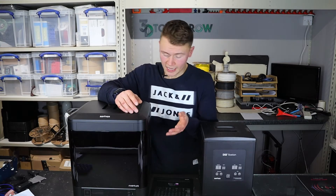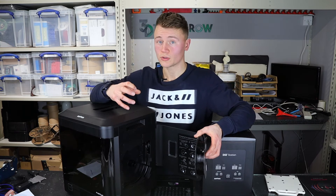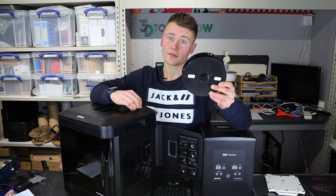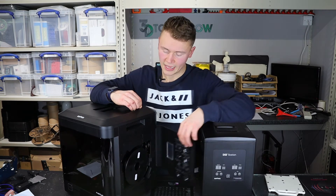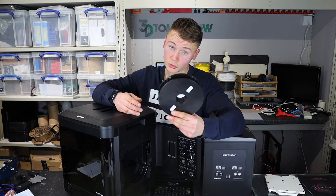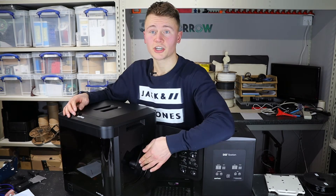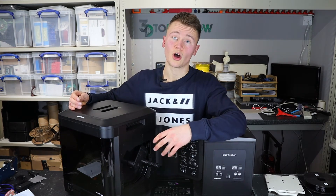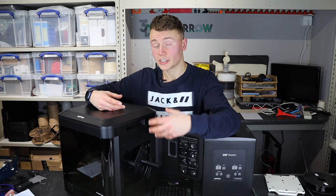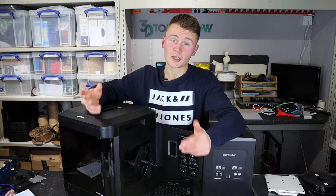The second thing is that this printer is designed for small spools. The space for the spools on the side of the printer is quite small, so you're limited on the weight of material you can fit in closed. No problem if you're printing with the little 350 gram Zortrax spools — they go in like a glove. But if you're doing a lot of printing with the same material, you'll be using the external holder Zortrax provide, which allows you to hold a bigger spool on the outside. When using external spool holders, the HEPA filter doesn't work as efficiently because you've got more openings, so ABS smells are more noticeable.